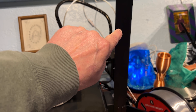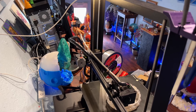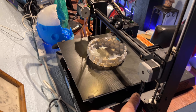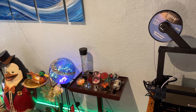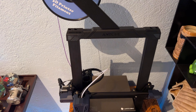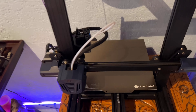The other thing is this gantry. Notice we have a motor on this side and a motor on that side. Here's a cheaper model so you can see the difference — notice it's not one piece of metal, it's wiggly. That three-piece design that you put together is not going to be as accurate.